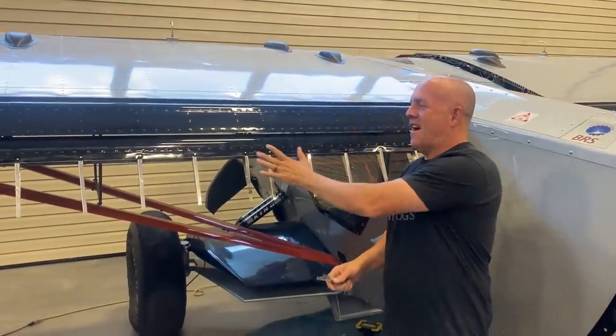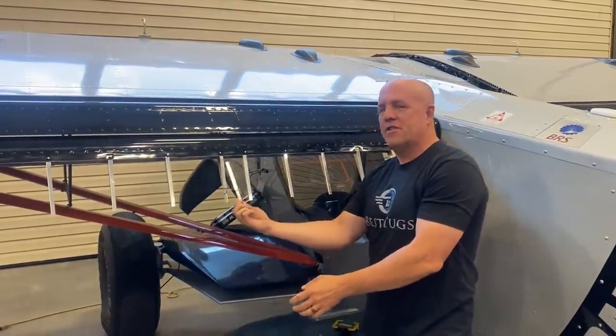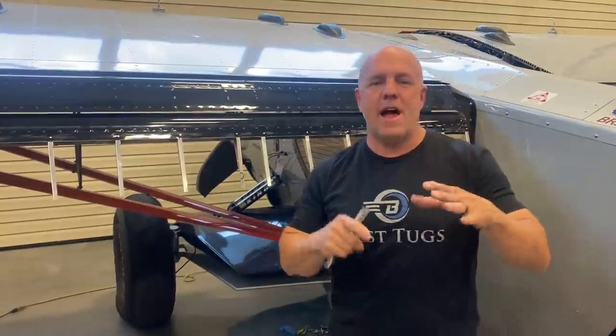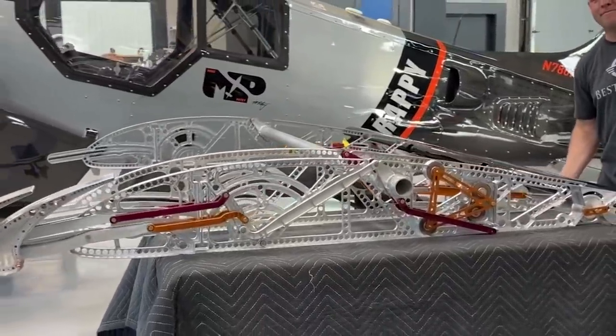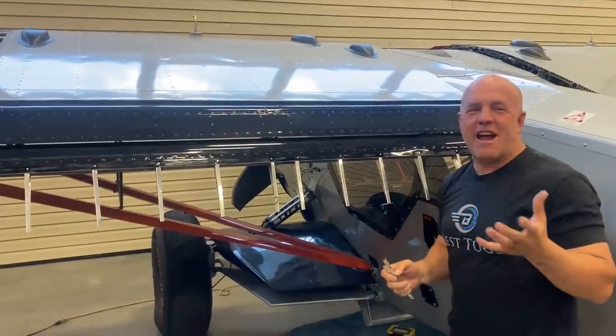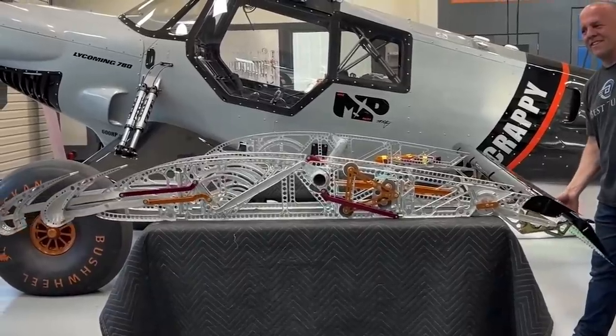All right, we're getting closer. I went ahead and decided to extend my flaps at the same time as my aileron. So this is the new little teeny baby rib we've made, and I've got them all installed. This double slotted used to end right there - so this is the extension. A lot of flaps just have one push bar that pushes the flap down, and if I only had one I couldn't just extend this. But since on Scrappy I did a torque tube that runs the entire length of the wing, I added multiple push rods that push the flaps. I've got all the structural loads I need to handle the extra forces, pushing at this point and about a third in from the other point.